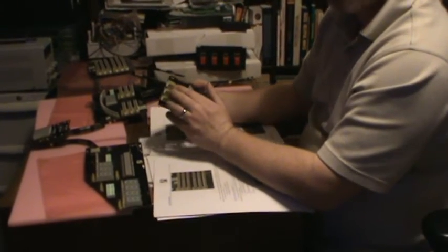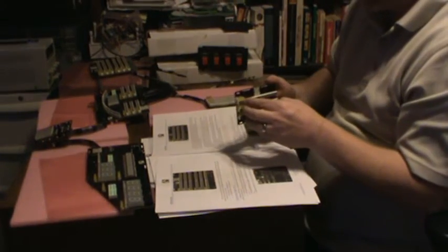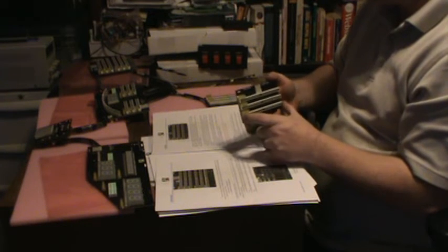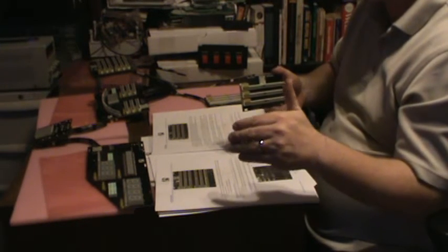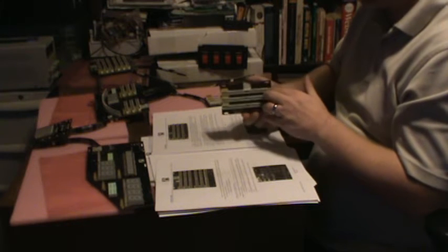One of these boards, he's actually programmed with functions. If you look at the overlay, it has instant and average miles per gallon, distance remaining on your tank, and I think it says range in miles, something like that. Anyway, it's information that can be calculated using your fuel consumption rate. So if you know how fast you're going, how far you've gone on a tank, and how much gas you have left, you can calculate these items.